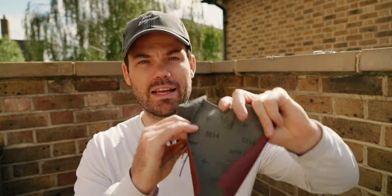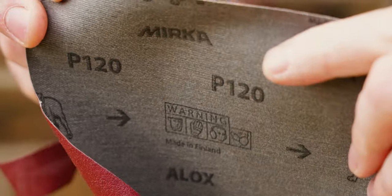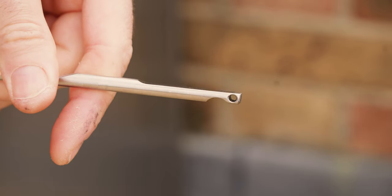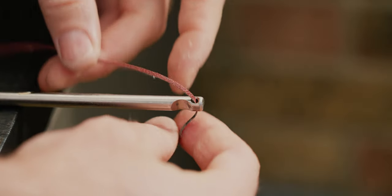The first thing you're going to need is sandpaper. I like to use this emery-style cloth which has a backing on it — it's a little bit more robust than regular wet and dry sandpaper. I cut them into small little strips like this so they can fit inside the hole. For the initial polish of the hole, and then after that step I'll show you how to get it super shiny, super polished, and you'll never lose a shaft this way again.